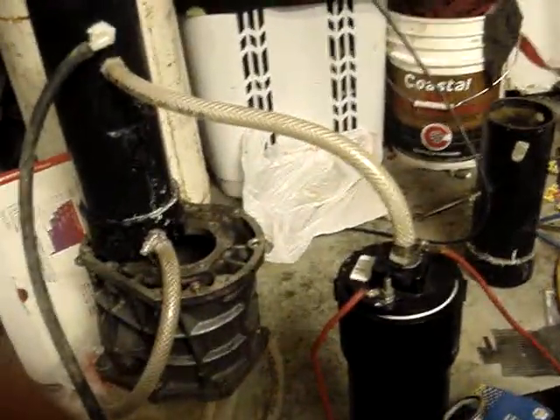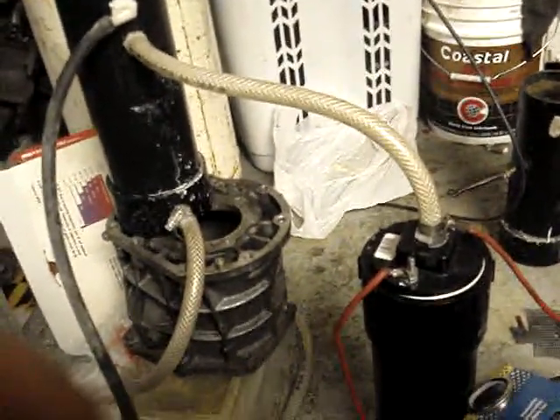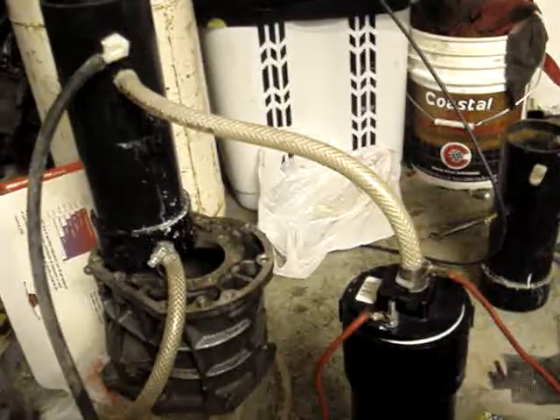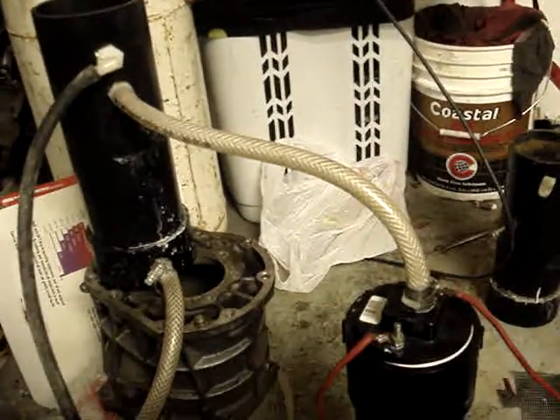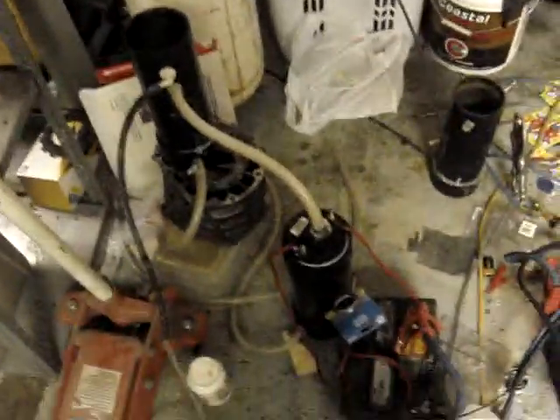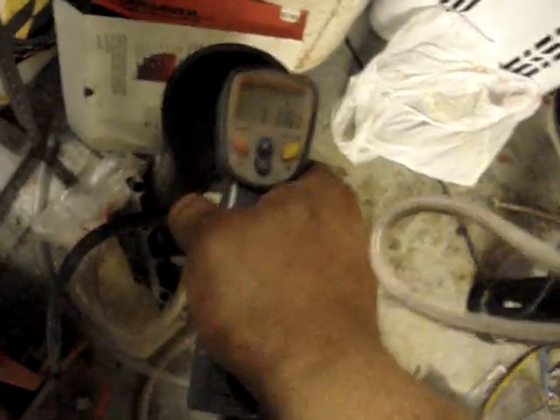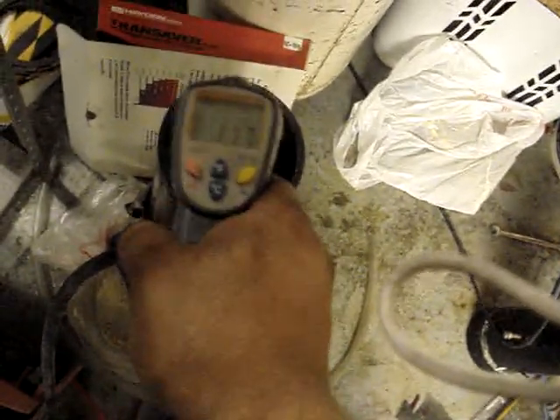Here's what's new at Higher Power Performance — Higher Powered H2O. This is a 31-plate cell. It puts out about 2.2 liters a minute at 30 amps. Right now it's been running for four and a half hours. The ambient temperature in the shop is 70 degrees, and in the cell it's about 117. So the convection cooling actually works fairly well.